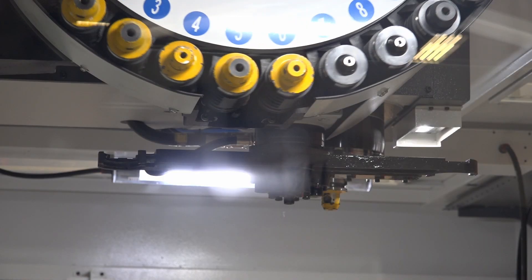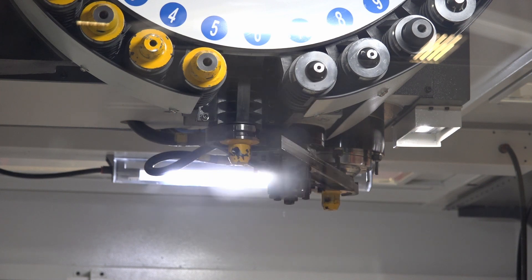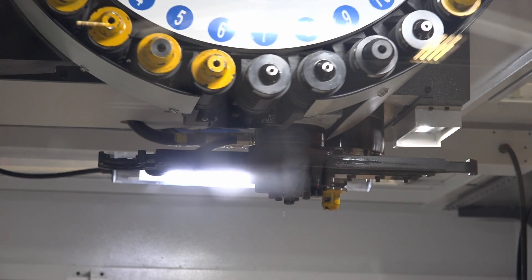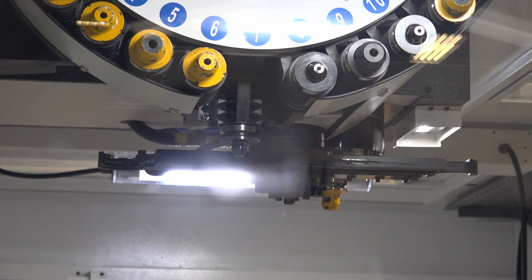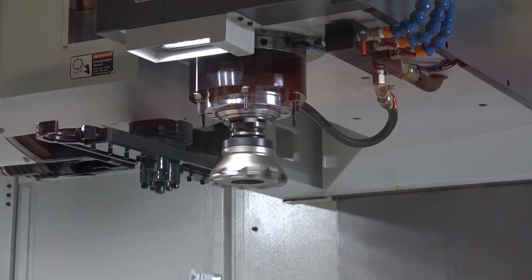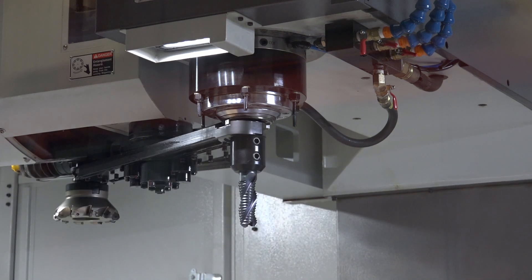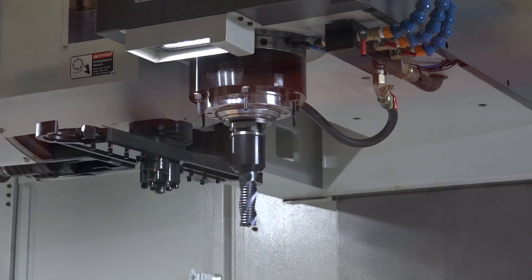All of the Super Heavyweights have a spindle running at 10,000 RPM, belt drive. But if you'd like to take more advantage of the power available from those large spindle motors, you can upgrade to a BT50 spindle. That will drop the maximum revs to 6,000 but will give you far more grunt lower down.